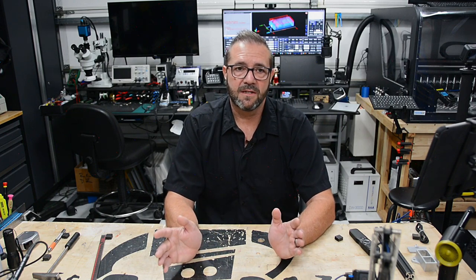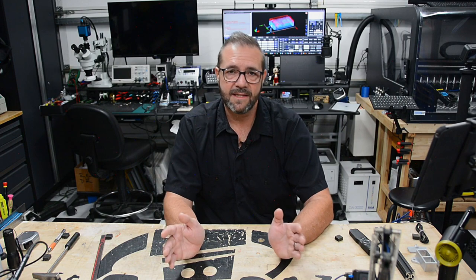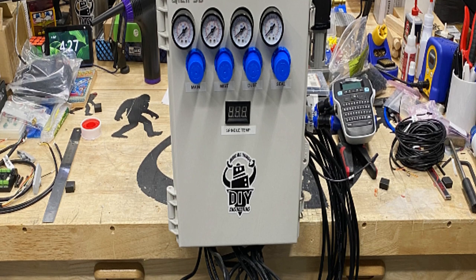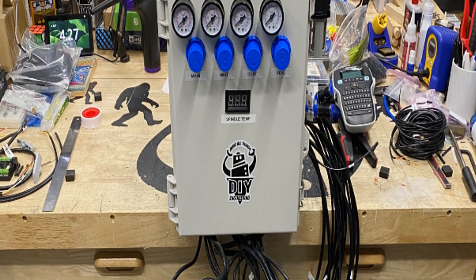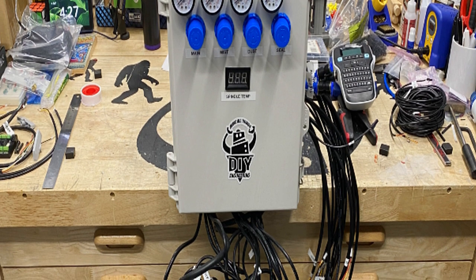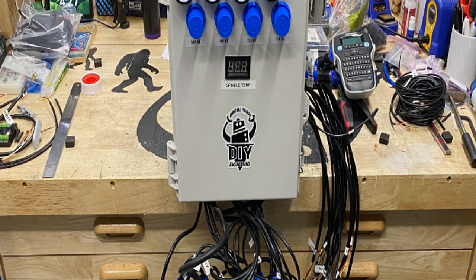Now, getting the pre-wired control box with all of those modular systems with an AXBB in it is a big step in the right direction, but it's not going to address all of the ATC pneumatics. And for that, I needed to develop and wire a junction box with all of the pneumatic switches and map all of the wires from the existing HDM wiring harness over to the new control box. That's a lot of work.